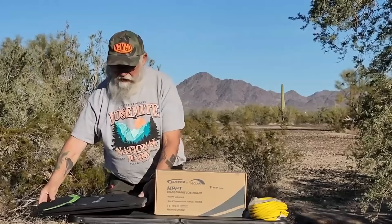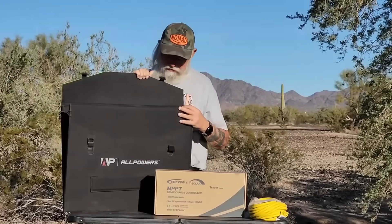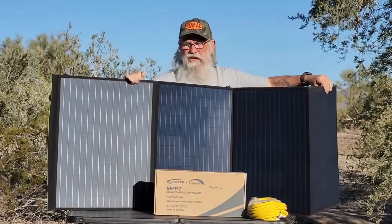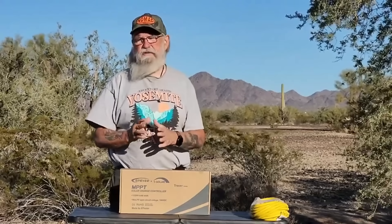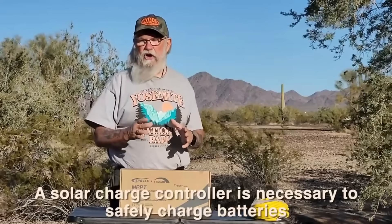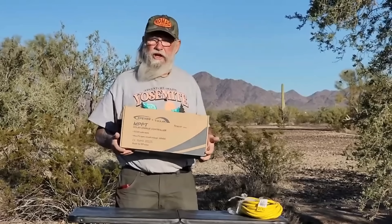Hi everyone, welcome back to my next video. Today we're going to talk about solar power. I haven't shot a video on solar power in quite a while. I'm in the process of installing an external system — by external system I mean I have one of these folding panels that I'm going to take outside and power and charge a battery in the side. I did a review on this once; I have two of these, and one's a different brand. You can't just connect those directly by a wire to your battery — that will kill your battery, even a lithium battery with its own built-in BMS battery management system. It still needs an MPPT controller to give it the optimum amount of power, and today I'm going to tell you how to go about choosing a charge controller, and I'll tell you all about why I chose this one by EP Ever.